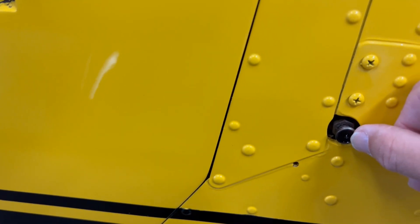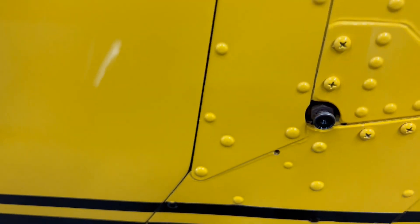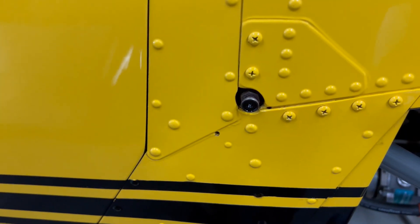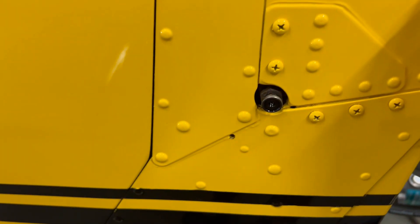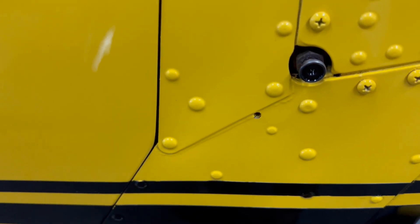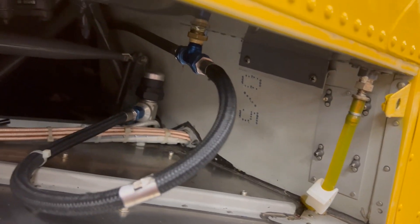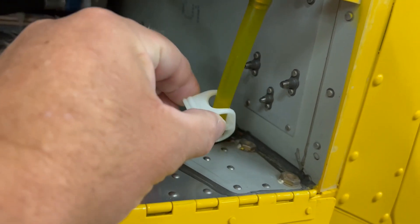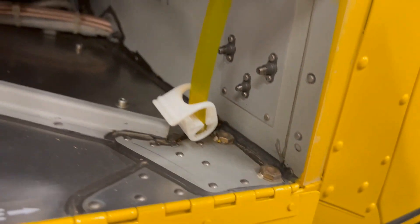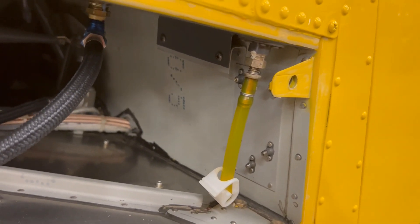When you drain these, push in on them and move your thumb out of the way quickly so it snaps back into place. If you push real gently and then ease off gently, it can kind of hang and drip a little bit. So when you sump the fuel, push in and just slide off to the side to pop loose and let the thing reseat itself so it doesn't leak. Be sure to keep these clips on, because if these things leak a little bit, they can cause some fuel standing up on the deck. That's the older-style, so we'll take a quick look at the newer-style.